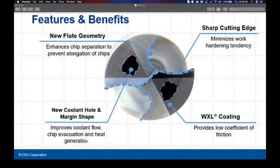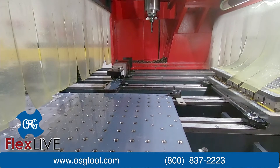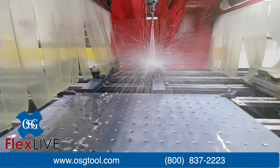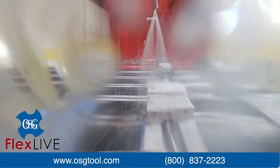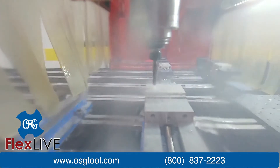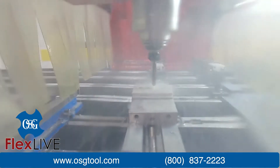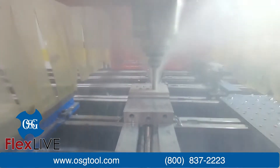A few things you'll notice that are different: conventional drills have round coolant holes, but this one has more square coolant holes, which provides 30% more coolant flow when drilling. In stainless, work hardening is a main issue, and this drill combats that with a wavy cutting edge, sharp cutting edge, square coolant holes, and a really slippery smooth coating. This helps minimize tap breakage caused by work-hardened holes. It looks like there's an ample amount of coolant going through that tool right now — definitely not short of that. We're going about 71 and a half inches per minute.